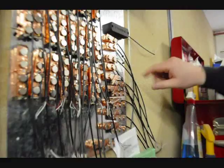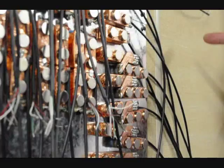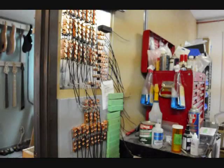Now, you'll notice that some of them have circuit boards. And so that would be on the split coil ones. That's the FD3s? FD3s, yeah. Okay. And so the circuit board does two things. It pre-wires the coils, and it holds them together, and it also spaces them, gives them the right length. Which really simplifies that process. Okay, and then you just fit them in the shells after that? Fit them in the shells, yeah.